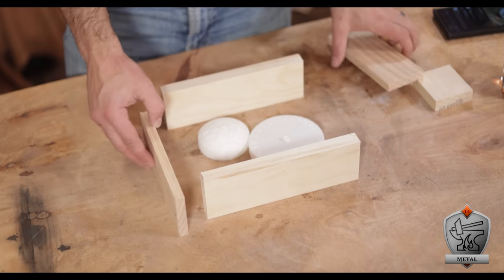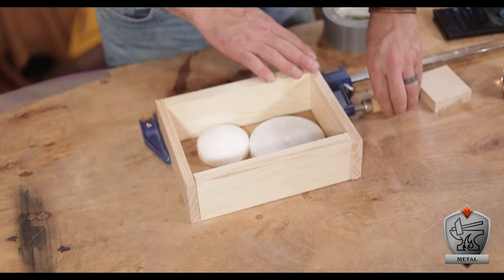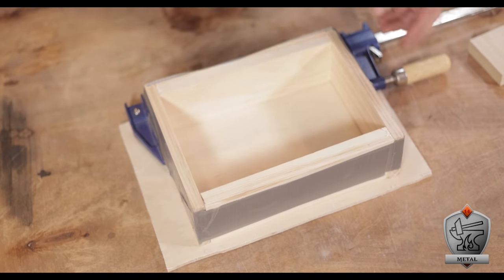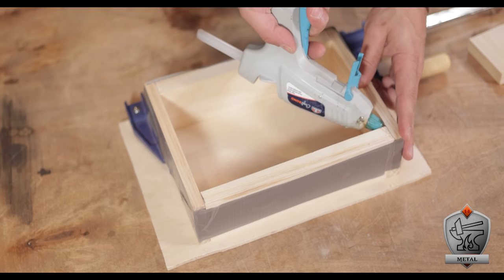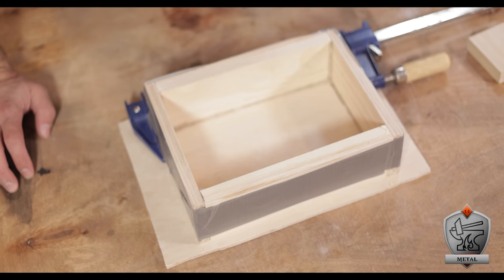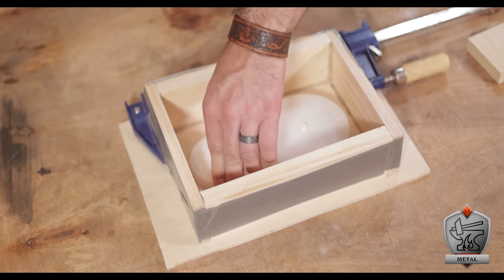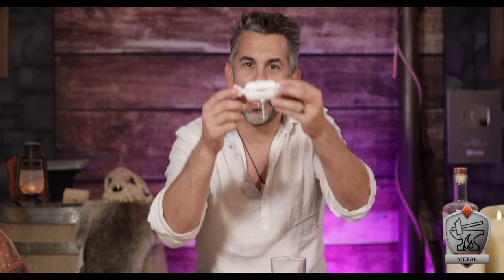But I want this thing to feel weighty — like an ancient thing. So we're going to cast it into some silicone to make a wax mold we can try to use for the metal parts. First I cut pieces of wood to build a little frame around the prints. I clamped them tight and reinforced the edges with duct tape, then placed it on a piece of plywood for a bottom. Since we need to take it apart later, I sealed the edges with hot glue along all the joints. I also added hot glue to the bottom of my 3D prints so they won't float to the surface — a 3D print is mostly full of air.